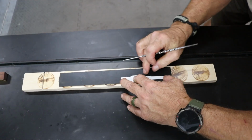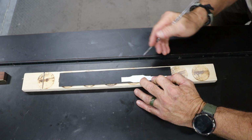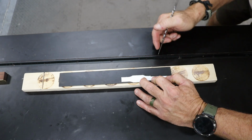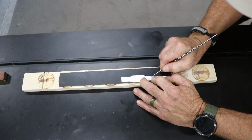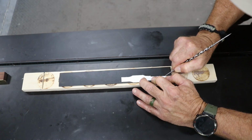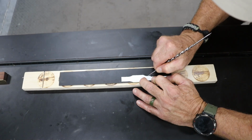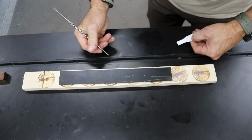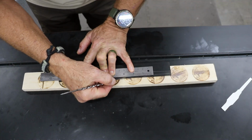First up, I painted both the steel and brass flat stock black. Why? Because it makes the scribed layout lines easier to see, and also because black just looks cool, like tactical chisels. Then I cut out my paper drawing. It's to scale except for the blade length, and I used that as a template to transfer the design onto the steel blank. Nothing fancy, just good old paper and patience.